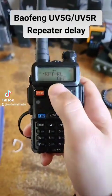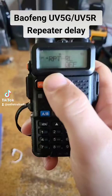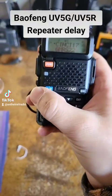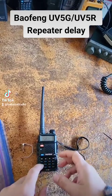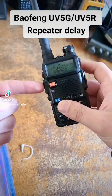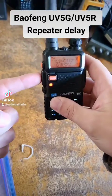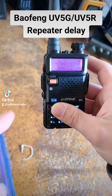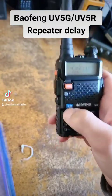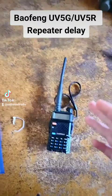What this stands for is the repeater squelched tail on the repeater's delay. What it does is when you key up and hit this repeater, that will happen. You won't hear the noise coming out of the radio, at least not at first.